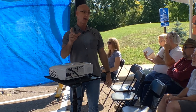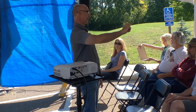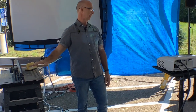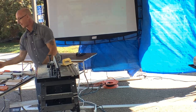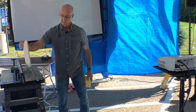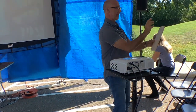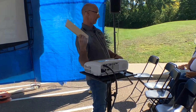If you need to end up with narrow parts, you're gonna use this to do whatever, screw trays, and you only want them to be 3 inches deep. Work with 6-inch wide parts. Those narrow pieces are nearly impossible to safely handle across the router table. But if I do all of that to this piece, then when you get to the groove step, you groove and you groove. Then you go to the table saw and you rip 3 and 3 or 2 and 2, whatever you need. Then you have your narrow box. But don't try to handle the narrow box pieces on the router table.